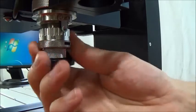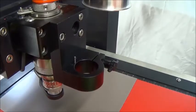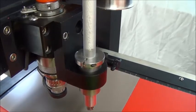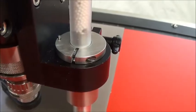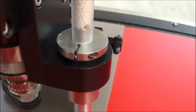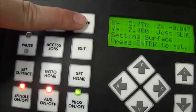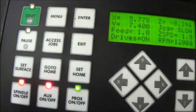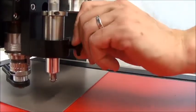Now we set the surface for the braille pen attachment to establish the amount of pressure used to insert the raster spheres. Insert the raster braille pen into the vision bracket and locate it correctly by rotating it until the pin on the bracket enters the hole in the ring. Do not tighten the nut that locks the pen in place at this time. Lower the spindle until the raster braille pen rises above the adapter and the ring is almost flush with the top of the locating pin. There should be about a 1/16th inch gap between the ring of the pen and the bracket. On the controller, press the set surface button and press enter to set. The spindle will raise slightly indicating the surface has been set. Lift the pen high out of the way and lock in place by tightening the nut on the bracket.